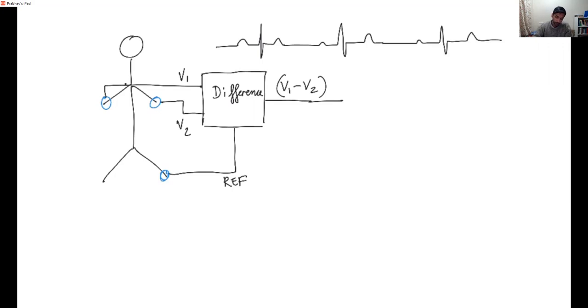The signal at the output would look like a typical ECG — regular spikes whenever your heart beats. The signal has an amplitude of around 10 millivolts, it could be a few millivolts up to around 10 millivolts. The baseline offset is not zero volts — it could be somewhere around 200 millivolts, maybe 100 millivolts, and it changes depending on the person and the electrodes.